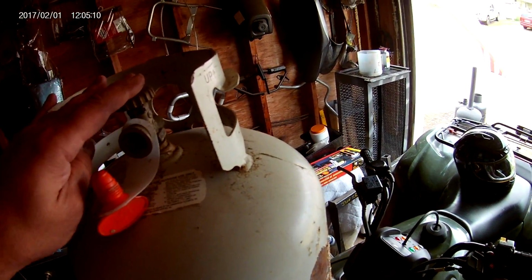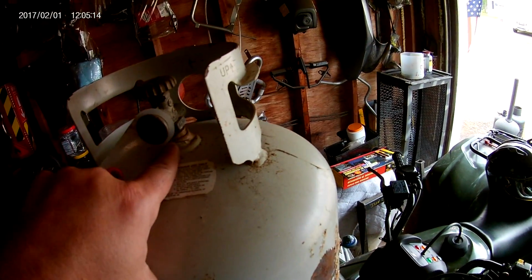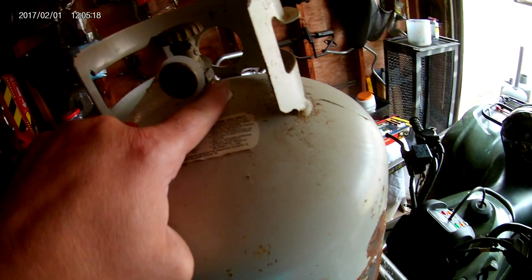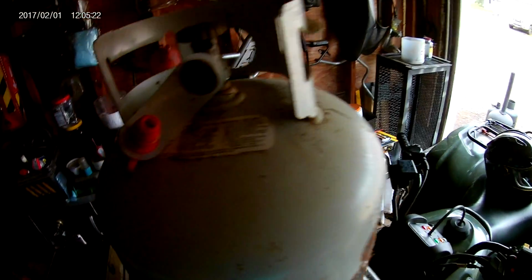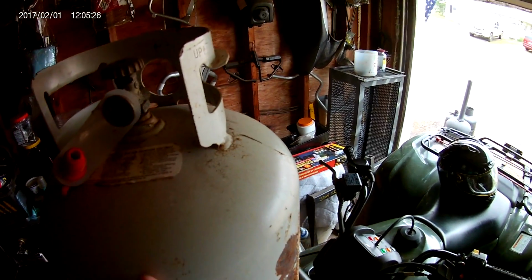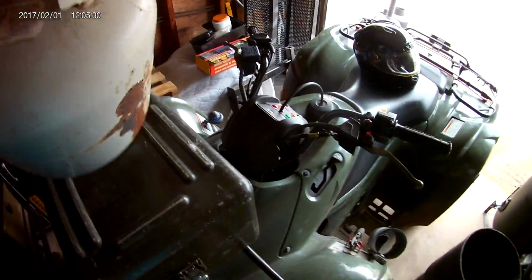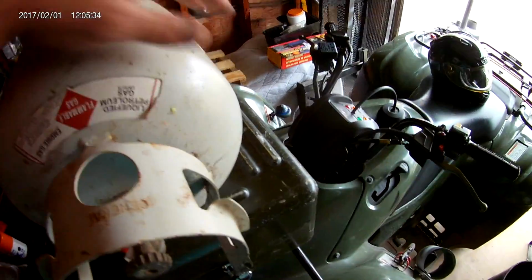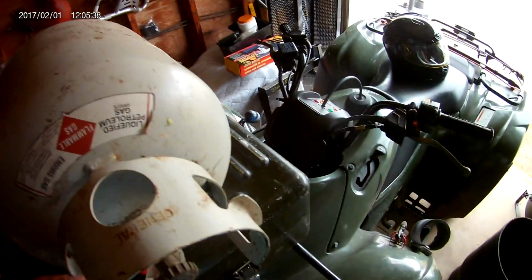Valve stem removal. Very difficult to get this out because it's put in with an epoxy, and they actually don't want you taking this out, but this is what you're going to start with. So if you're like me and you're going to need something pretty hefty to hold this, what I did was make a jig for it where you turn it on its side like this and it holds it on each side, and I put rubber grips on there to hold it really tight.